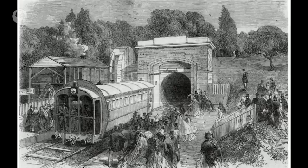I thought it was worth including a section about low pressure and vacuum pneumatics. It still has a surprising number of uses. Probably reached their zenith in the 19th century with the atmospheric railways. So the whole trains were the pistons, which sealed against the tunnels, which were effectively the cylinders they travelled through. And these worked by vacuum, sucking the trains through the tubes. Never successful, they could never really get the seals to work, partly because the leather kept being eaten by rats.